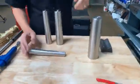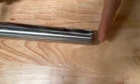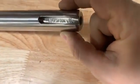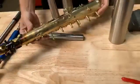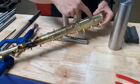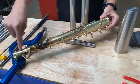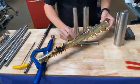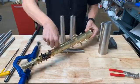If we had a giant mandrel, what I would do with it is I would cut that mandrel up so that I could work on one part of the instrument at a time. If you're working on the body tube of an instrument like this one, and you put one mandrel in the whole body, there's a really good chance that you're going to hit, say, here and somewhere down here, and this spot in the middle is going to be raised. And if you have to take a dent out of it, you're going to push this down to the mandrel.